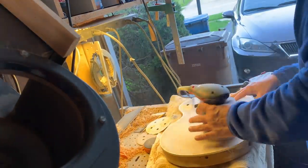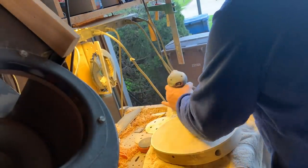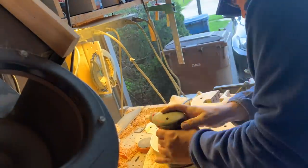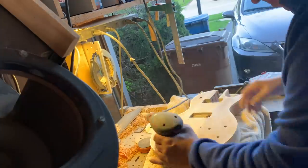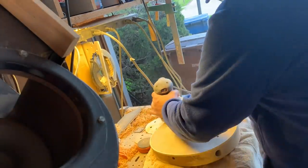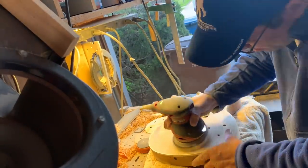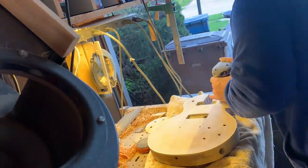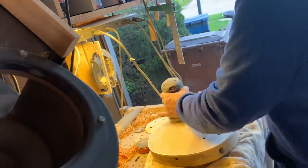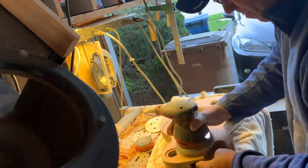Then sanding. We started with 120, to 180, to 220, to 320, and get this all ready and set to be done. This took a little bit of work — I know you guys wanted the video earlier, but I had to figure out what to do with the headstock logo and inlay. I've got a felt carved relief pad on here that allows me to follow the curves, and we're going to sand for way too long to film the whole process. But now the body is done.